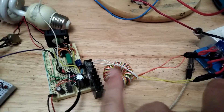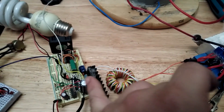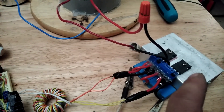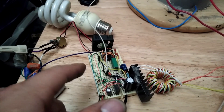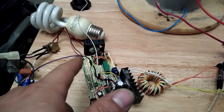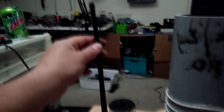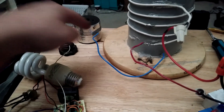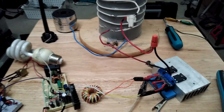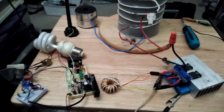Still waiting on circuit boards, cleaned up the wires a little bit, made the leads shorter. I tried to add the interrupter portion of Steve Ward's circuit but it didn't do anything. I think I've killed the enable pins on these drivers by putting over-voltage into them. I've got a little antenna set right next to the bottom of L2, hooked to a piece of metal, and I'm going to run it at rectified smooth mains through the dimmer to see what it looks like in the dark.